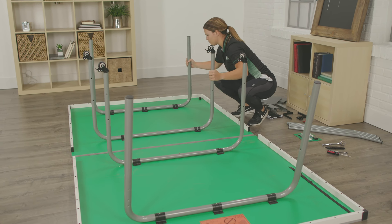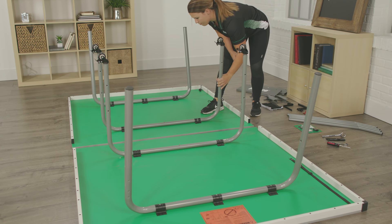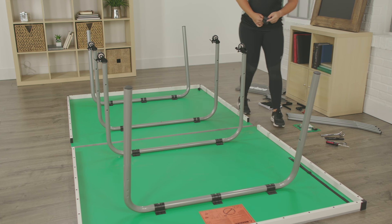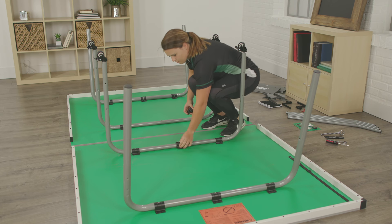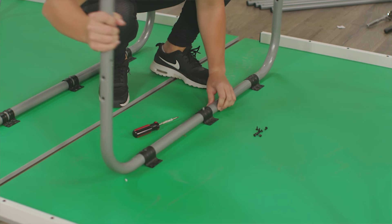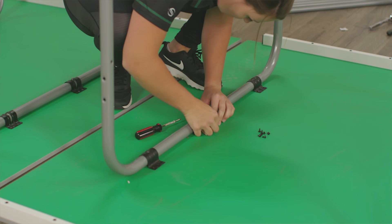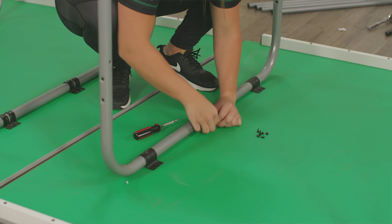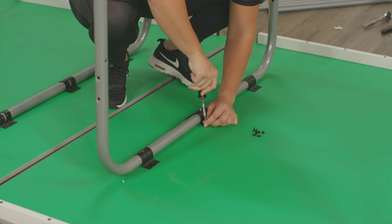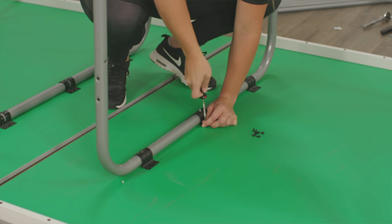Start by swinging the legs into an upright position and align the pre-drilled holes on the table with the ones through the legs. On the two middle legs, you should find a small notch at the center of each beam — center this notch with the pre-marked holes for the brackets. Take one of the P4 brackets and line it up face down with the pre-marked holes, then line up each H8 screw and tighten them. Be cautious not to over-tighten the screws. If a power drill is used, make sure it's on low torque. Repeat with the second bracket on the second middle beam.